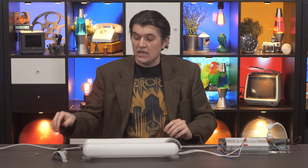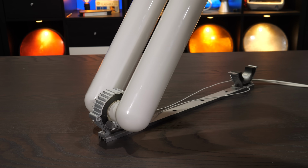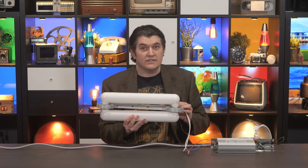It looks a little strange because it's going way over there before looping back to the core, but that's what it is. Now, because this lamp is so large, we need a second core positioned on the other end of the tube, but they're wired together and so act as one. When the alternating current being sent through the wires by this driver unit induces magnetic fields in the cores, those fields then induce a voltage inside the fluorescent tube. And because it's formed in a loop, that results in current flow, which causes the lamp to light. For that reason, this is known as an induction lamp.